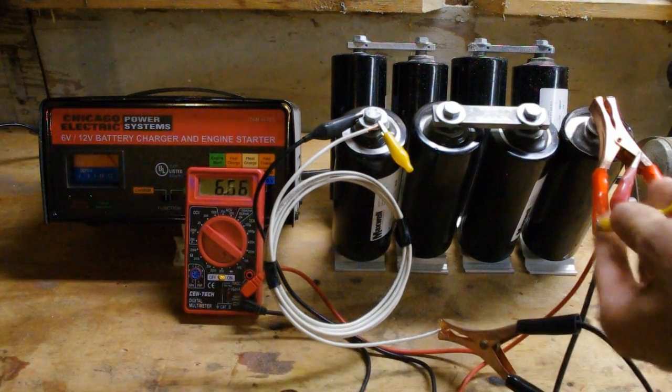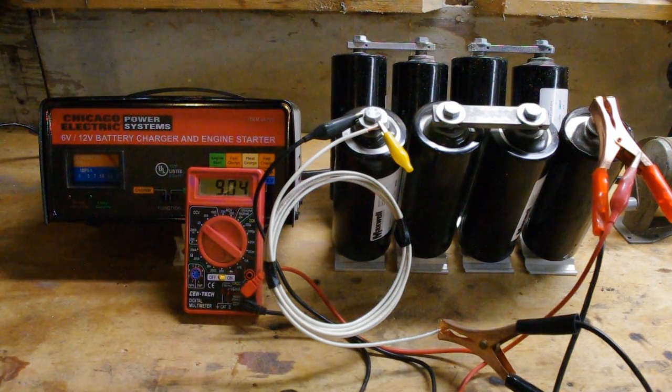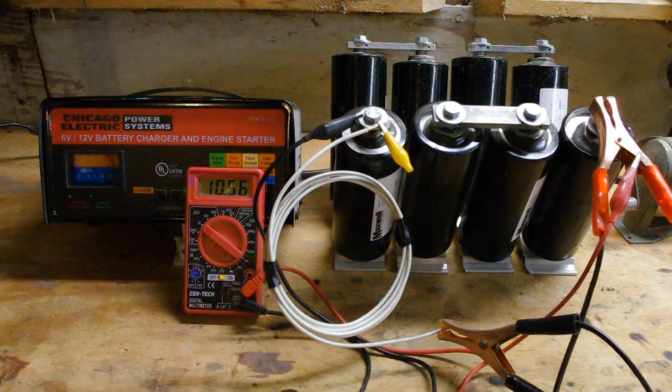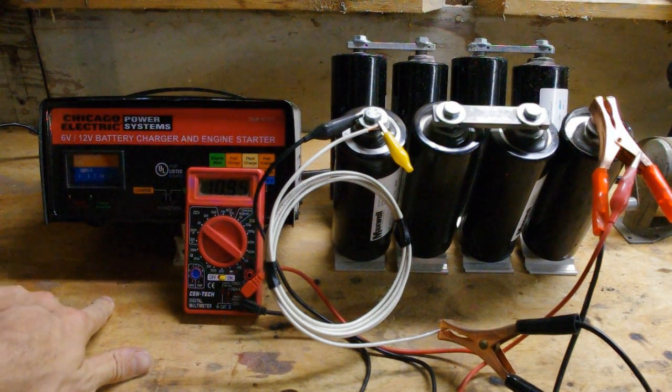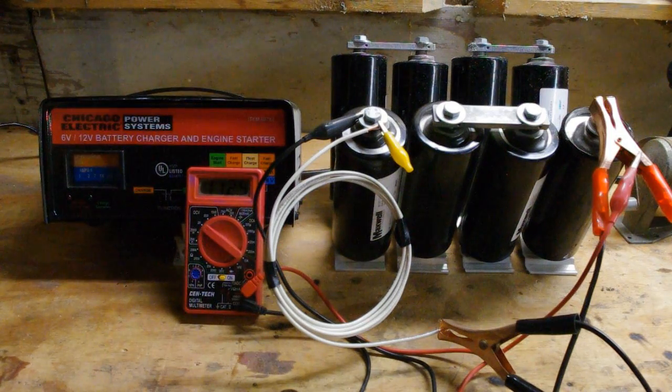That thing desoldered itself when it got hot — look at the wire here, come out of the side. It can handle that for a little bit before it shuts off. If you have a charger that doesn't have a shutoff like that, you'll want to definitely use more wire; otherwise you'll just burn it up. You'll notice there's stuff inside that glows red when you're doing this. This is a tremendous amount of energy we're giving these capacitors right now. As we come up to voltage, this thing's fluctuating a little bit — it's going to draw less amps as you come up to voltage. We're at 10.7 right now, and it's actually on its way down — it should drop to zero as these capacitors come up to charge.